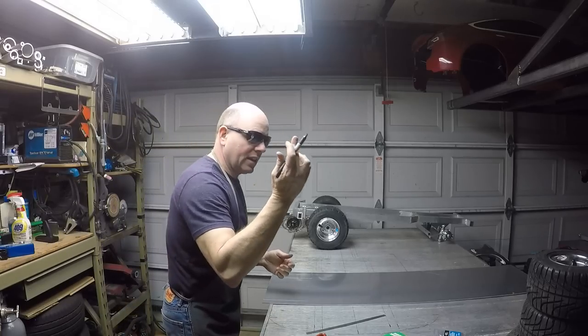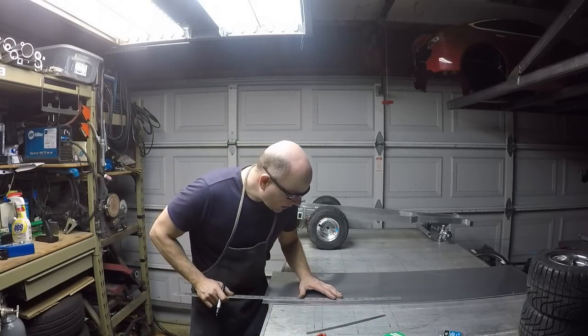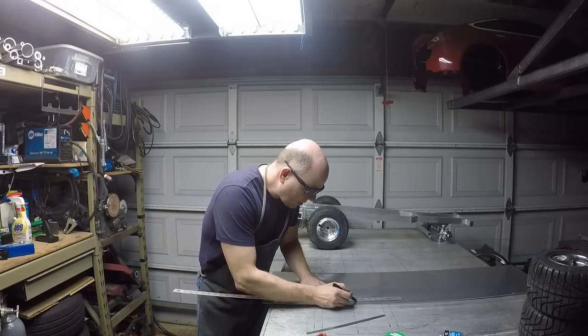There's the entire shape — the front portion I'm going to cut away, the rear cutouts, and the light blue colored portion with the plastic is the shape that will be left. I'll pull this plastic off, and I'll still have the scribe lines. Then I'll use the plasma cutter to cut it all out. Now that all the plastic is removed, I'm going to transfer all of my scribe lines to Sharpie marker so I'll have something I can follow with the plasma torch.